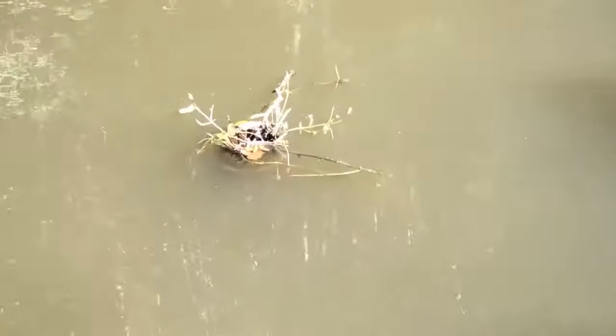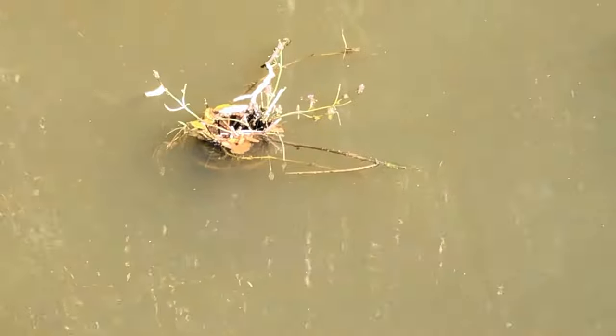This pipe that you see right there, that's a 6-inch PVC pipe. I've got sticks and everything going on it. I have a raft that I can float out there and clear that off. There are multiple sections of that pipe that I have threaded, male and female in, so I could take off a 1-foot section, then I could take off a 4-foot and another 4-foot section. So I can raise and lower the water to whatever level I want.